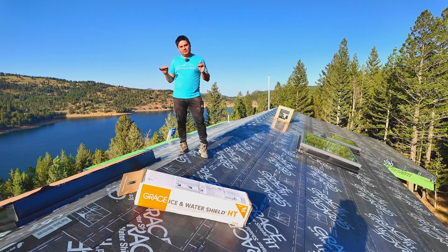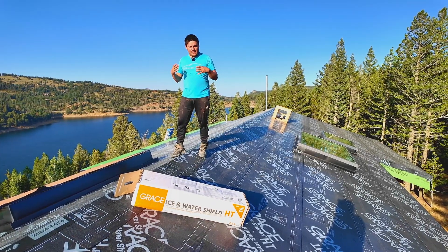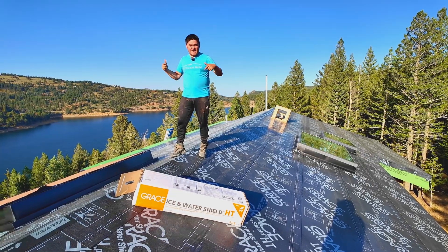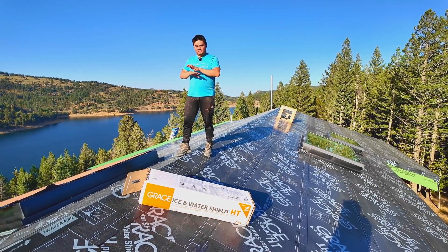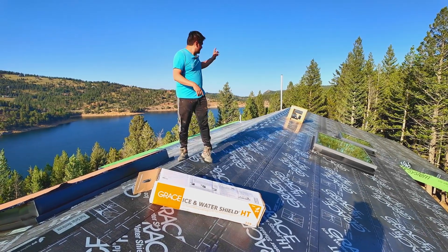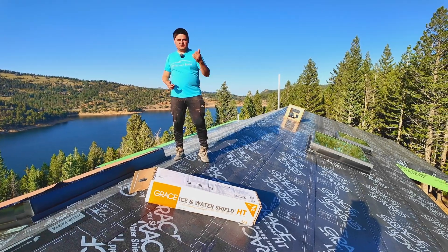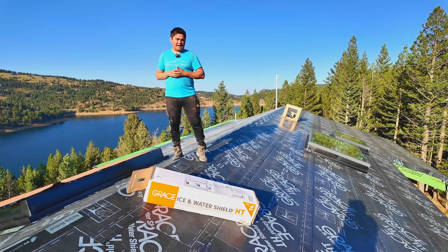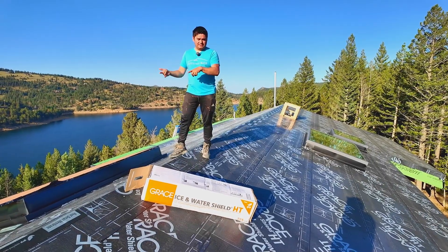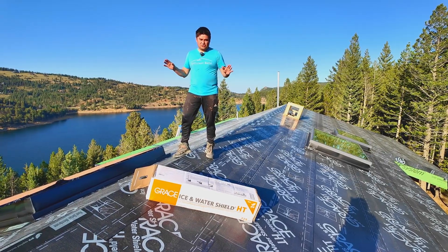It's very important to mention a couple of things related to how we build. We only build mechanically ventilated houses — we never build vented attics or vented roofs. That's why you see us completely covering everything and we don't have to worry about it. You might see something that looks like a chimney there — that's because we get some of the exhausts from the attics through there. The attics are part of the building envelope. What's going to happen next is we're going to be working on installing the solar roof — which, by the way, is also a CertainTeed product and it's super beautiful.